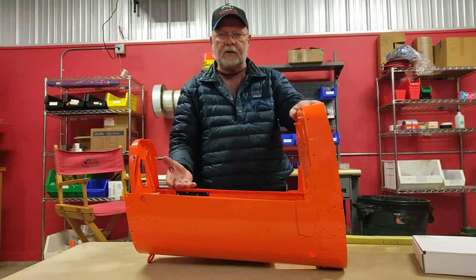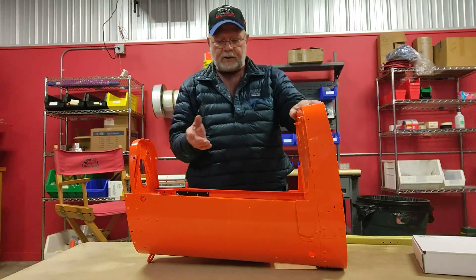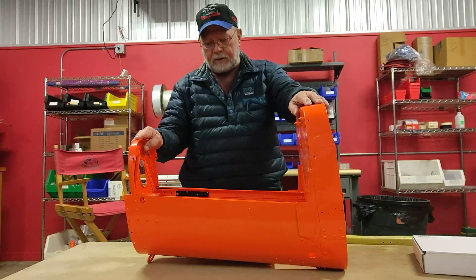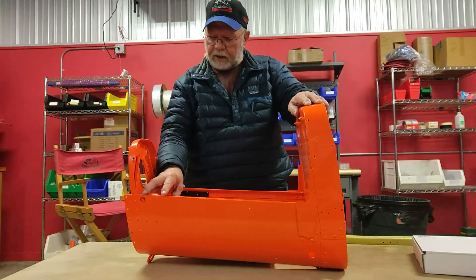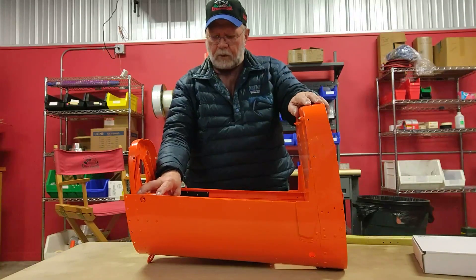As you can imagine, these two rivets right here are carrying the load of the airplane when it's flying — the load on the horizontal — and unless you're upside down, it's always from the bottom up. So it's carrying a significant load. I don't know what the weight would be — there's so many times gross load test weight or whatever figured out. But anyway, just these two little baby rivets hold this and they start smoking.